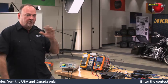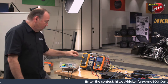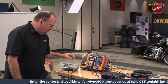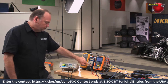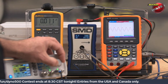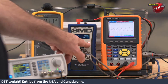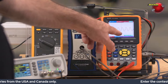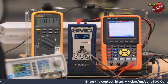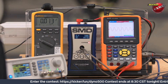Going in for another run — there we go, tickle the clip light, you can see we're clipping on the waveform. On the SMD AMM1 we're at 53 watts of output power and again 13 amps of current drawn through the clamp meter. He let it run for an extra 30 seconds and no smoke.